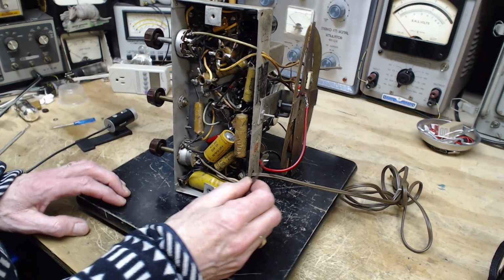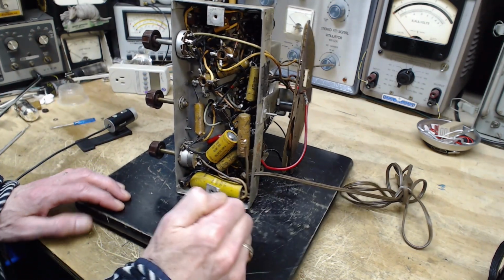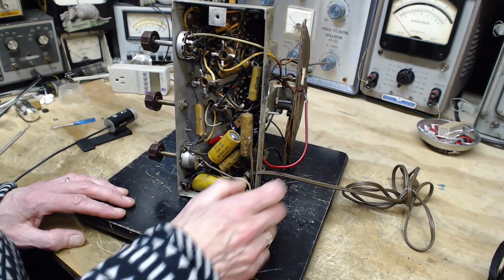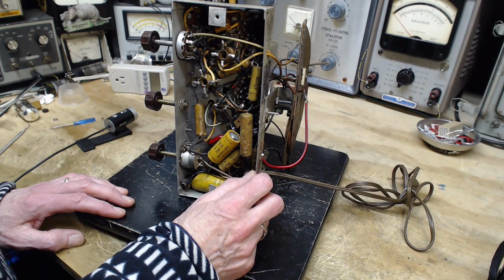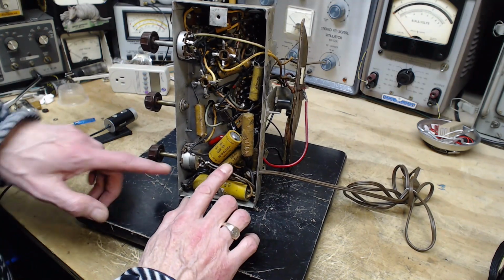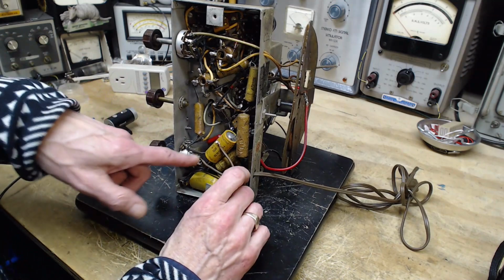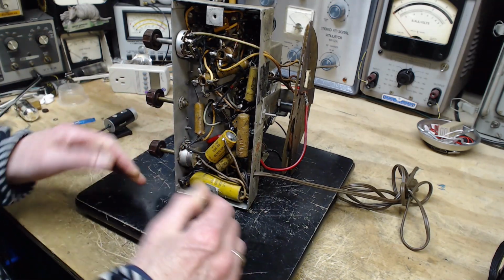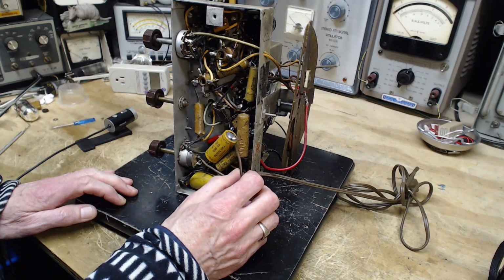Well, good thing I found this. Didn't just rush and plug it in. Now what if I had plugged in this radio with this wire hanging out here? Well, maybe it's touching nothing, or maybe it's in effect touching the other wire somehow, you know, through the components, and there's a real, what you might call a bolted short circuit in here. That would be the worst case.